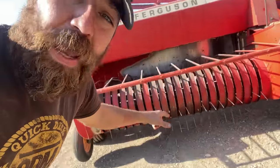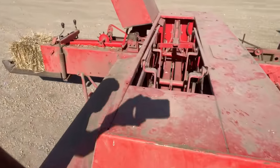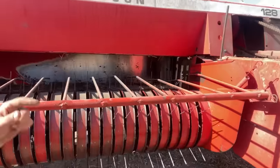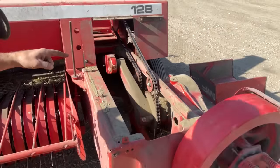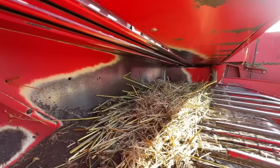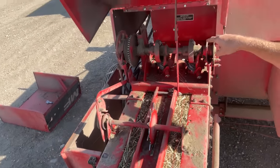So how does this thing work? Basically, the straw gets picked up here into the pickup. And then you can see these fingers on the top — they drag the straw over into the side chamber. And you can see here there's a plunger going back and forth. As they drag the straw in, the plunger pushes it back out the back of the baler. The bale gets twined in here. There are two big needles that come up where the end of the bale is going to be — they've got twine in them, and there's a couple of hooks and a wipe arm. Basically this thing ties two knots in the twine in less than half a second, and you've got a knot and it's starting on your next bale.